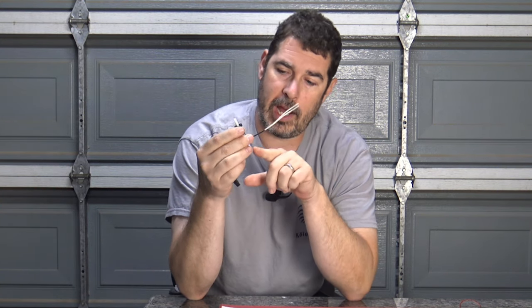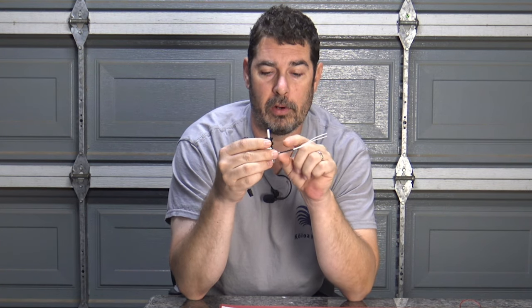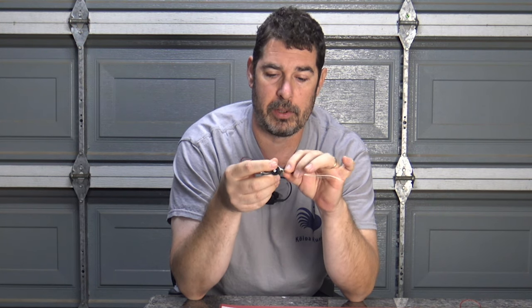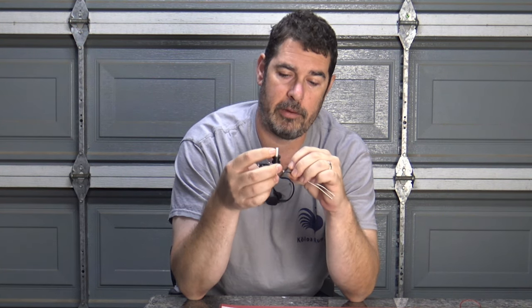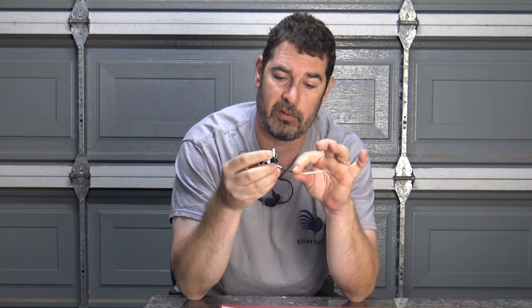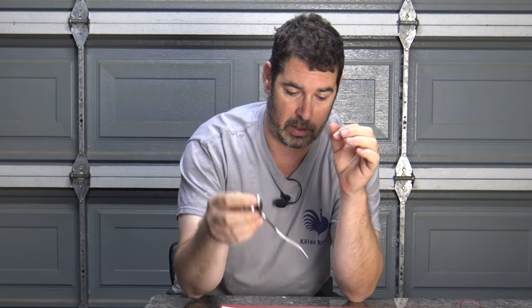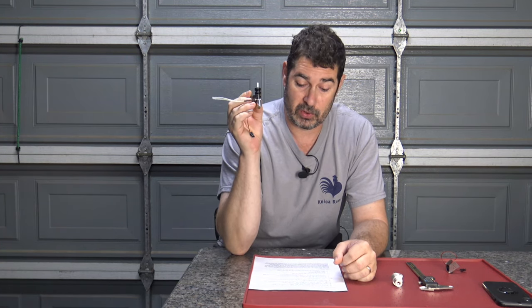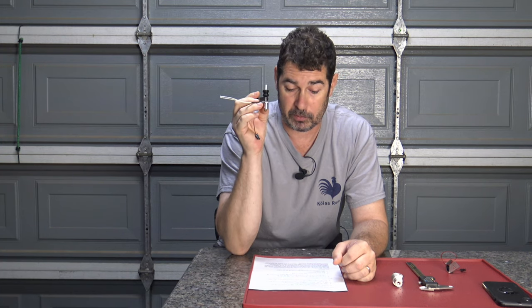Also, I don't have the original thermistors, but all of their cabling and their thermistors and their heater cartridge cabling is all reinforced. If you can see here, there's like a metal tab that comes with this that provides a strain relief so that this isn't just going to break or bend as it comes out of the unit. So they are all reinforced. It works direct drive, Bowden, or in any configuration that you want. And height wise, again, they're 39 millimeters short and they are 28 grams when fully loaded with the heater, thermistor, and fan.